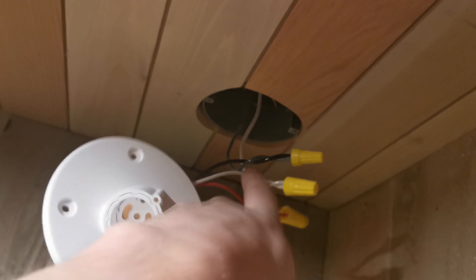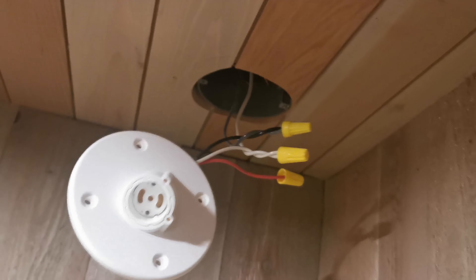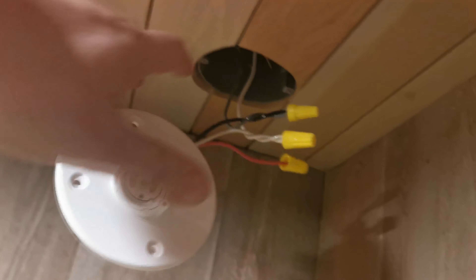Tuck your ground in — if it's hanging down or was connected to the plug before, that's that bare copper wire. Again, make sure that red is capped off. Tie your white together, tie your black together. Make sure those wire nuts are nice and tight — you should be able to do a pull test. If they come off, it wasn't good enough.